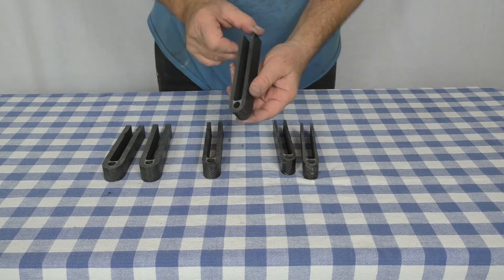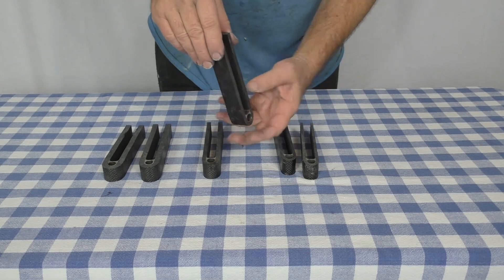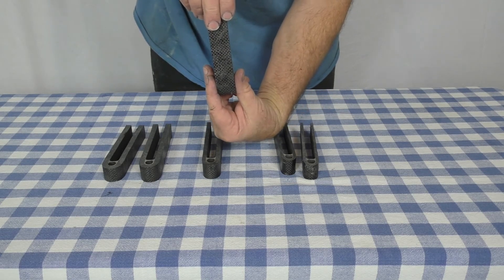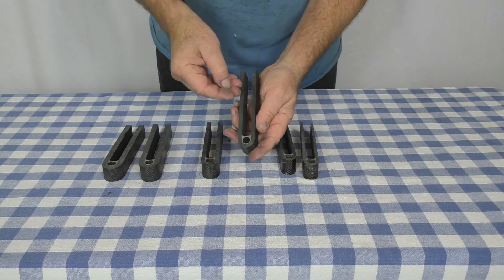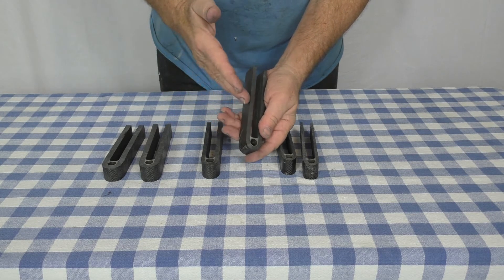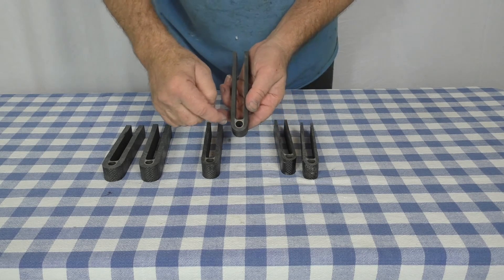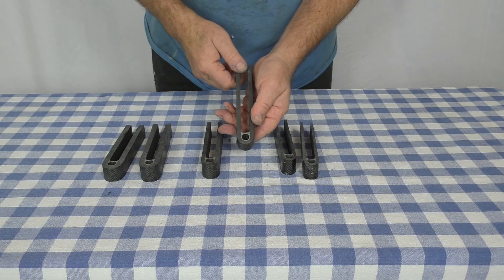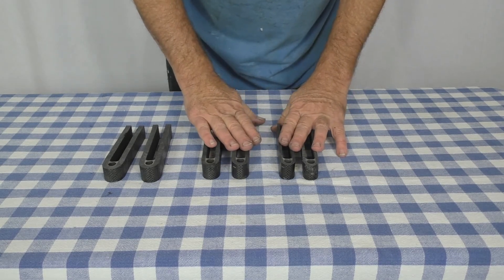What they're going to do at the lab is mount this on a steel plate — bond it to a steel plate, put it up in a test fixture, put a pin through here, and pull down until it fails. The idea is to provide a large bonding surface so that there isn't a failure in the bond. I'm not interested in testing that aspect of the design. What I'm interested in is the pullout strength of the hoop that goes around the bushing where the pin is going to go through, and hopefully this design will isolate the test to that area.